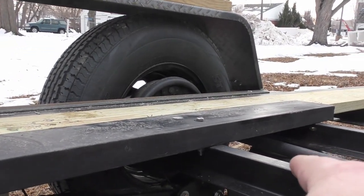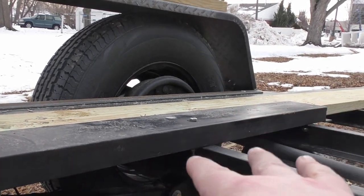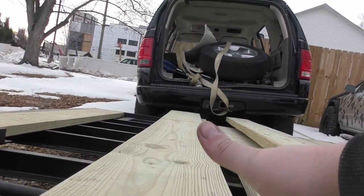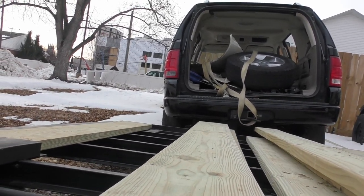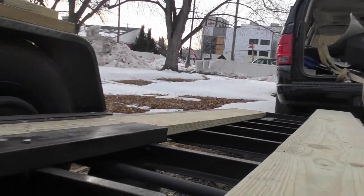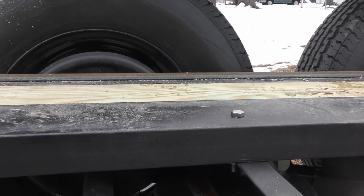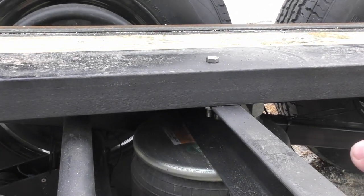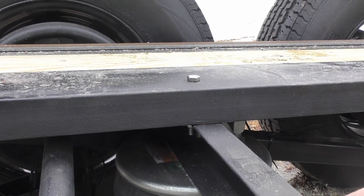Kind of like the same thing, if you end up going side to side, you could hypothetically push down on one side and it'll cause the other side to raise up. So it creates kind of a neutral thing, which is what you want front to back, but not side to side. So what I ended up doing was putting a check valve on each side, so that way we don't have any of that side to side thing, and it should work quite well.